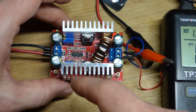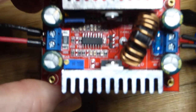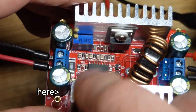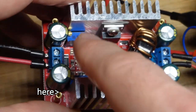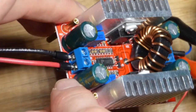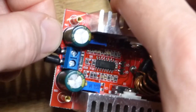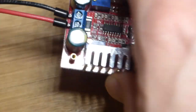There's the voltage trim pot and there's the current one. I believe it should say CV on one side and CC on the other. CV sets the maximum voltage out and CC sets the maximum current out — whichever is at its limit sets the output. The output has a positive where the red is and a negative. This is 16 gauge wire with ferrules clamped on. The ferrules just barely fit; if they don't fit, turn them 90 degrees and they fit pretty well. Then screw it down.